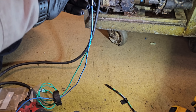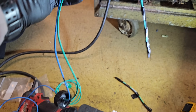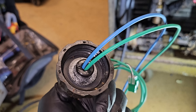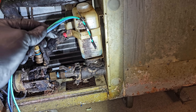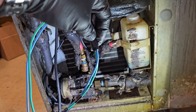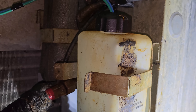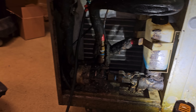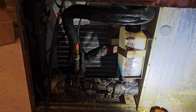You've also got to make sure you put the cap on. I mark the depth it needs to go, then ball up the tape so you can't pull the sensors out through the hole in the cap. If you silicone the cap, be careful not to block the breather hole — there's a breather in there to relieve pressure. It's a fine process of feeding the sensor down and finding the hole at the bottom. Once the sensors are run, the sensor cable gets routed. There's no cover — it's been missing for a long time — but the condenser is clean, so now everything else gets done from the front.